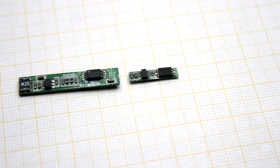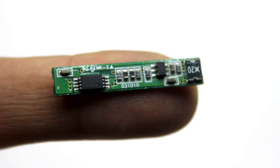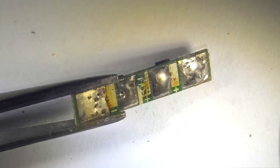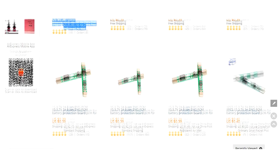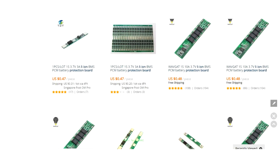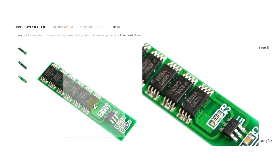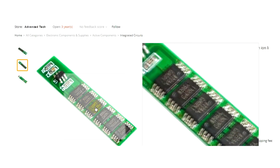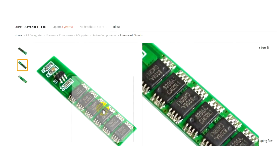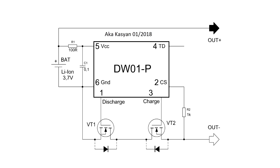The problem is that these boards are designed for a maximum current of 1A, but I needed a board with a current of at least 6-7A and more. Boards with a higher current, which are necessary for my purposes, cost less than half a dollar. Links to them can be found in the description, but I couldn't wait a month or two. A more detailed examination of modules on AliExpress made it clear that these boards aren't really much different from mine — the circuit is the same, only the protection current is larger. A larger current is achieved by the parallel connection of FET transistors.